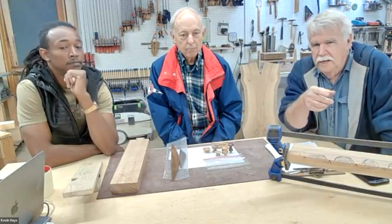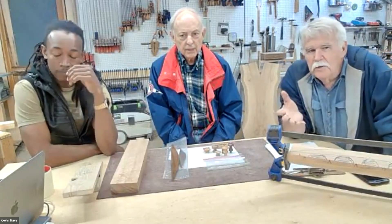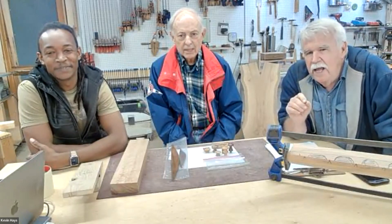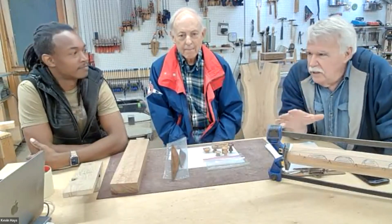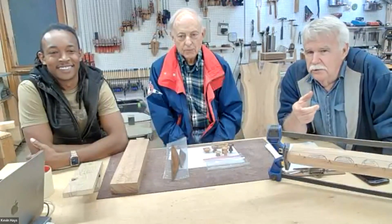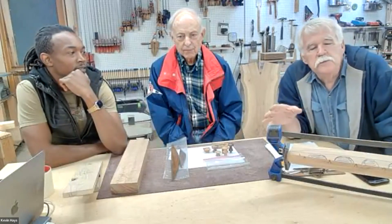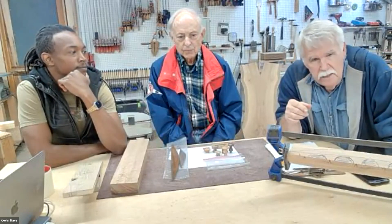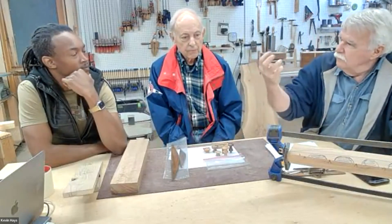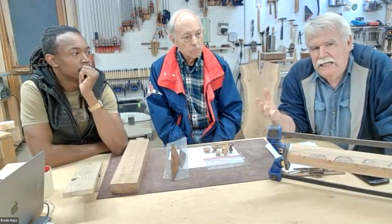I see Andrew — I think he's the guy I work with. He's an excellent hand woodworker. He cuts beautiful dovetails. Hopefully we'll get him to show his work in a couple of weeks. I use card scrapers on guitar builds. The card scraper is really good because you can form it. It's the difference between cutting the wood fiber as opposed to abrading it.